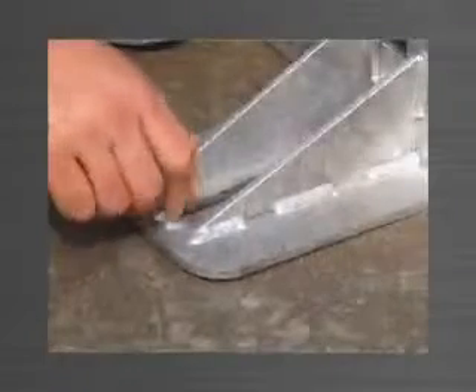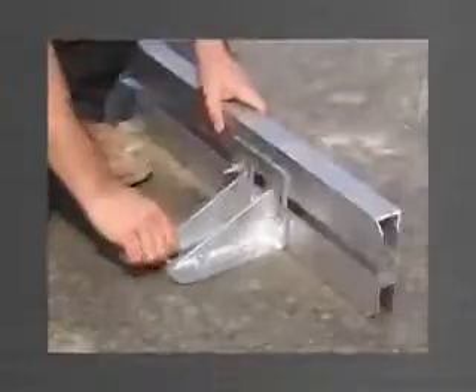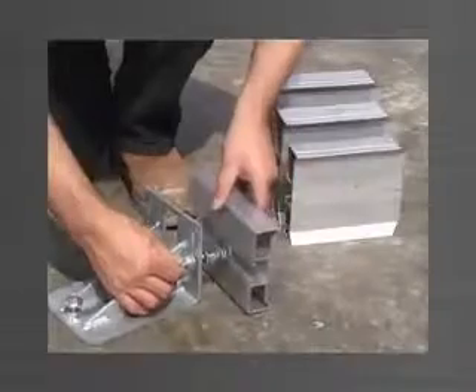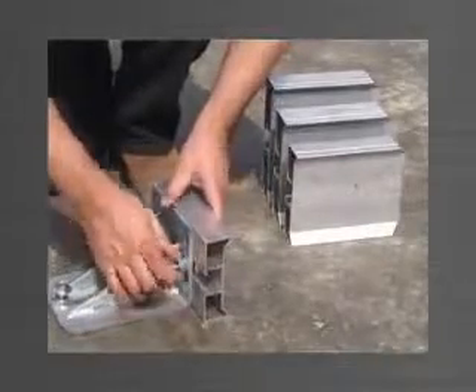The tilt adjuster raises the back of the bracket, causing the edge form to tilt until plumb. This feature is not required often, but is still provided as an option. As with all Panelware brackets, the top bracket will accommodate all four sizes of edge form. The top bracket does not protrude above the 125mm edge form, yet will still engage the 200mm edge form.